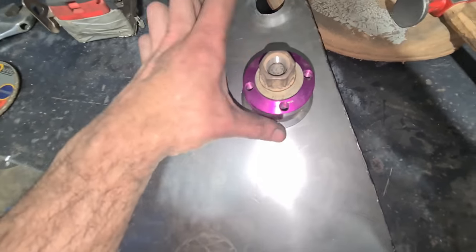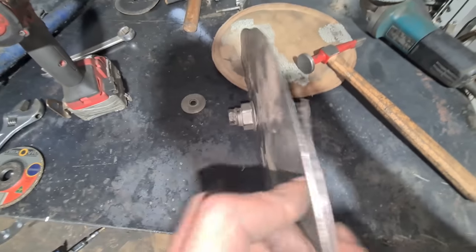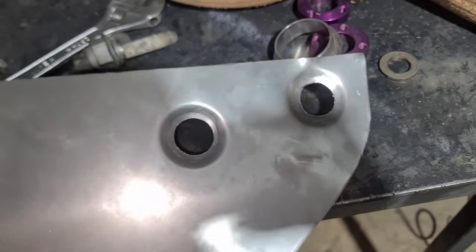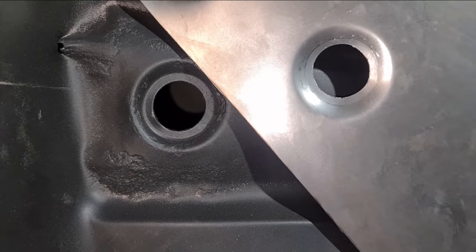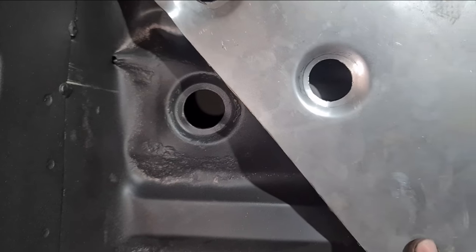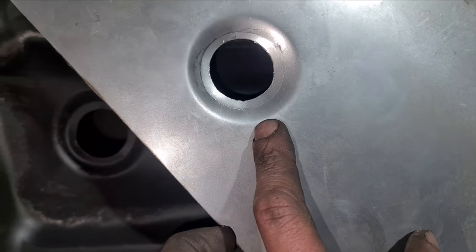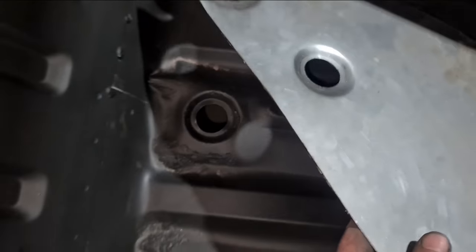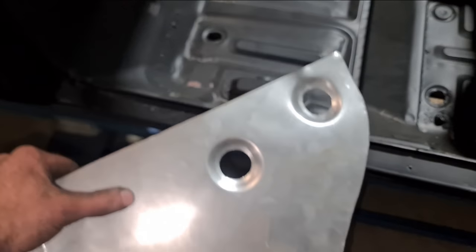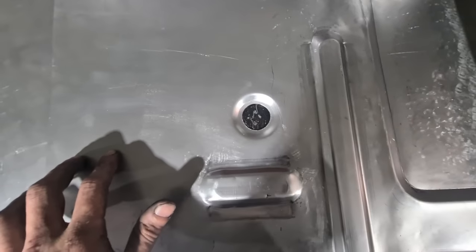Alternatively, just draw the outer diameter on the underside and check it before you tighten it up. Cool — there's your drain indent. Compare it to the car's one — in a suit. Same OD, same ID, same drain hole — the chamfer might be one degree off but I think it's pretty much the same. And that's drains added everywhere.